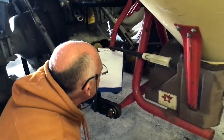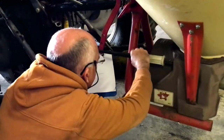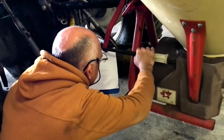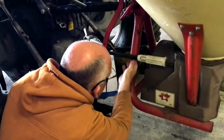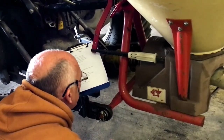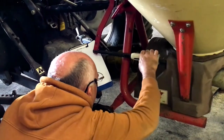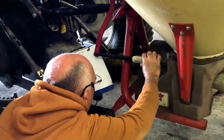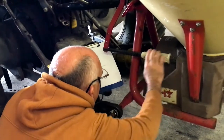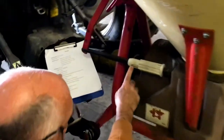According to the instruction manual for our spreader, reducing the arc of the spread can be achieved by lowering the spout to its lowest setting. This should result in an estimated spread of 6 to 9 meters or 18 to 30 feet, depending on the material. This is an ideal size spreader width used for small farm fertilizer applications.